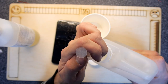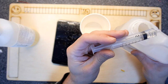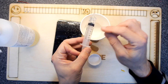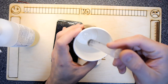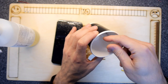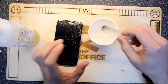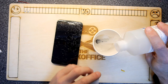Actually it did work, it worked. So let's see what we've got — nearly 3 millilitres. So we'll just plop that in there. It's hard to see in this light but you can see it's just a blob of resin, it's not too much. And then we'll just mix that with 30% of the hardener. Don't put your resin-y nozzle into the hardener, that would be a mistake. If you're going to do it use two syringes, but I'm just going to eyeball it because I think I can eyeball this.